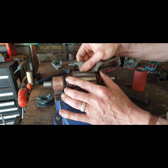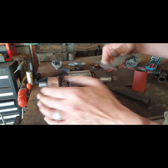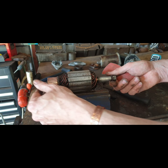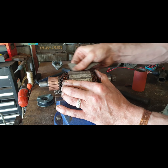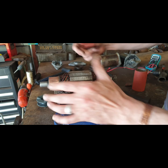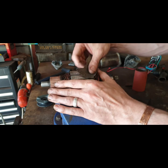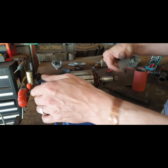So what's happening in the dynamo location there is you have the same poles probably turned towards each other, and there's that kind of opposition going on. And then you have your brushes here, one's negative, one's positive, and that's opposing itself, and then it starts turning. So it uses a bit of power at the start to power the field coils, and then once she starts spinning, she'll start creating her own power. Some kind of weird magic goes on, and a magnetic force creates power. And this is a motor as well. If you put your power into them connections on it, it'll turn. That's another test for them. Quick test to see is everything working.